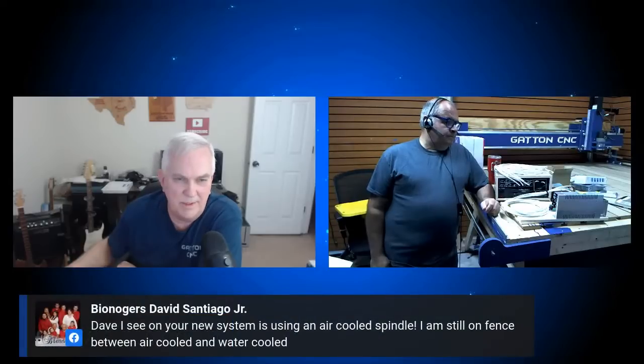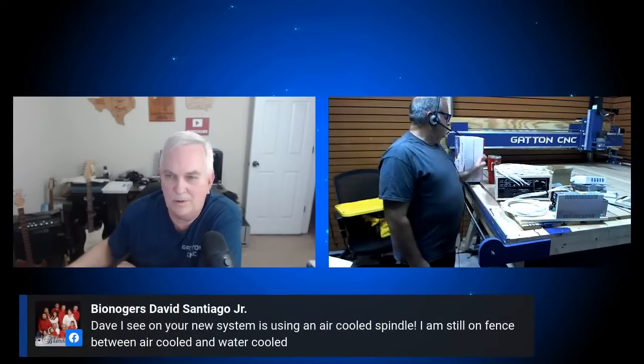Let's see here, Dave. I see your new system is using an air-cooled spindle. I'm still on the fence between air-cooled and water-cooled. Six of one, half a dozen of another. Just depends on what you want. I was always against water-cooled because I thought, I'm going to have a leak and it's going to mess up my board and this and that. And then I haven't had a leak in 3-4 years that I've had that thing. That just doesn't happen. It's low pressure.